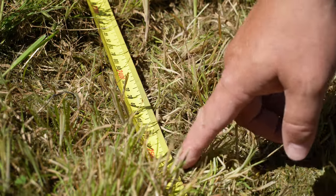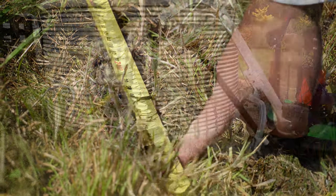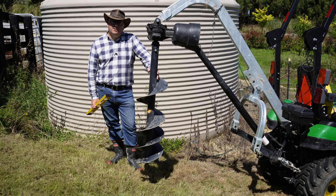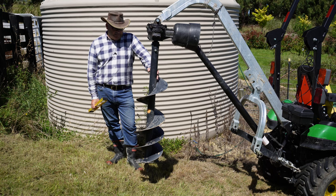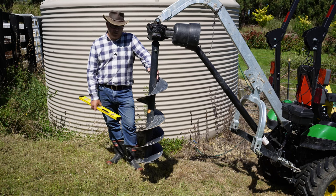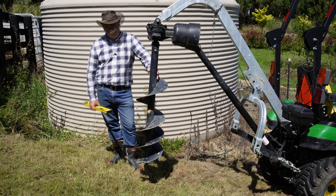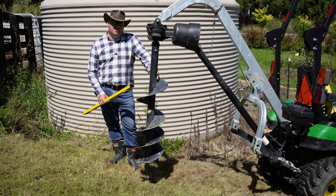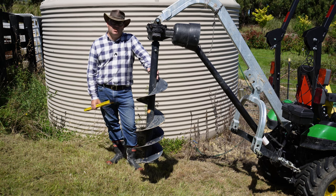So 2.4 metres for the top, plus we need to go another 110mm because of the diameter of the second post — that's going to be our centre. An auger is a really easy way to dig these holes. You get a nice straight hole going as deep as you're able, and it's vertical because you can easily work with a spirit level and keep checking on it. It's an awful lot less work, especially if you've got clay, which I have here. Augers quite often only go in one direction, so you need to be able to stop the auger and pull it out if you're going to hit things like roots or rocks.